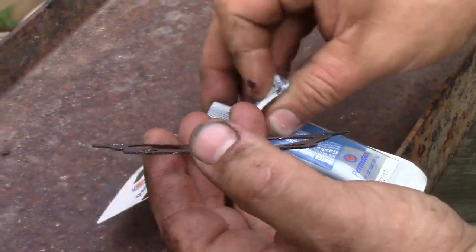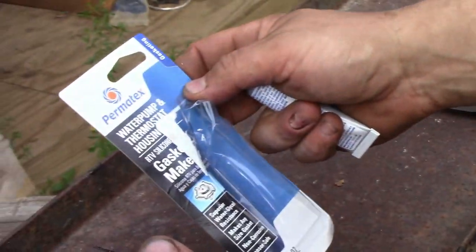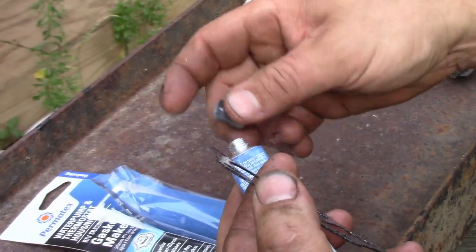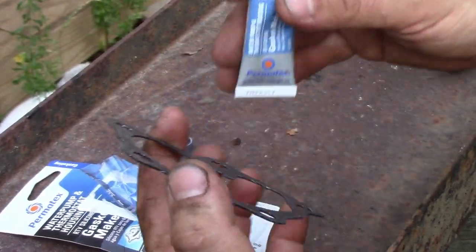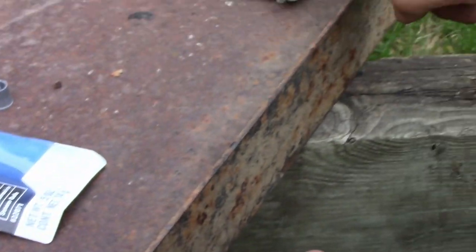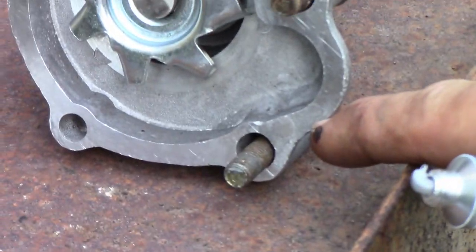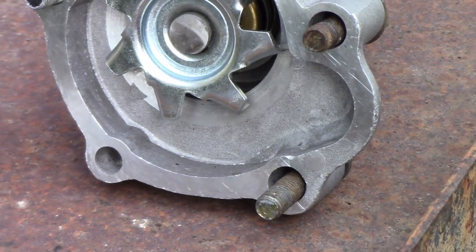Now, we have a small tube of water pump oriented gasket sealant. And we only want a very thin layer on both sides of this gasket. So it's only here to seal up the imperfections. Like this one. It's a fairly rough spot in the water pump there. Gee, if I had a mill, I'd fix that. But anyway,